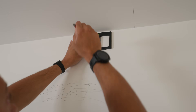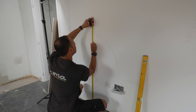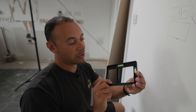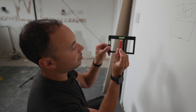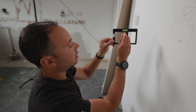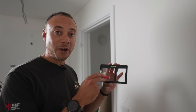The circuit is isolated so we're now ready to start work and start planning. Brand new — I just bought this especially for this job. This tool measures the size of the back box opening; if you're using a twin box for a double socket you use it as a template — it's got a built-in spirit level. For a single socket, say for a light switch, you use the single side. Really good piece of kit — I'll leave a link in the description.